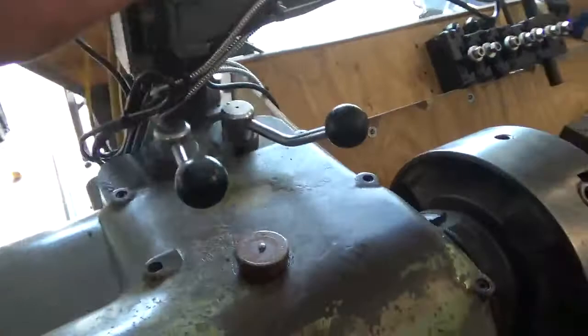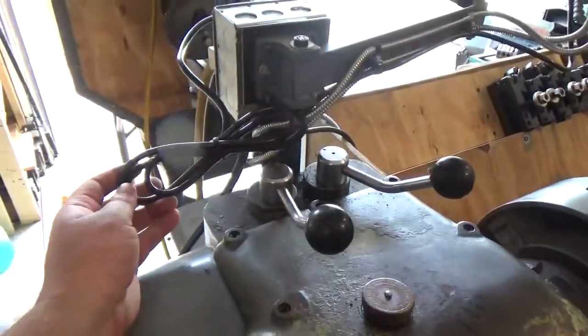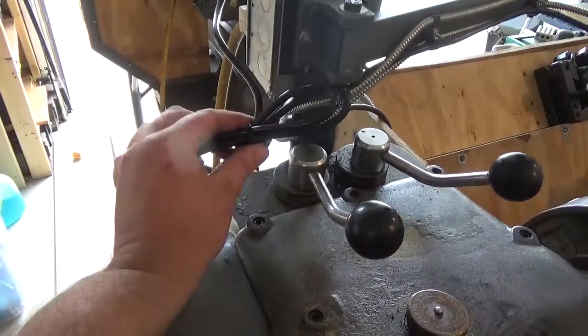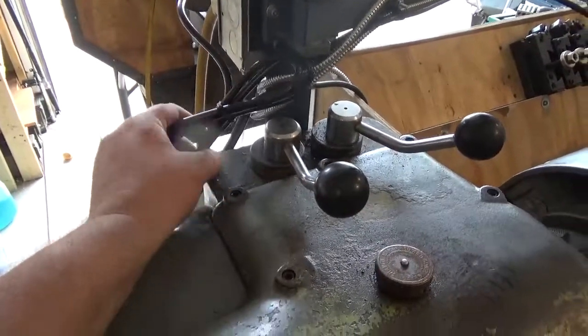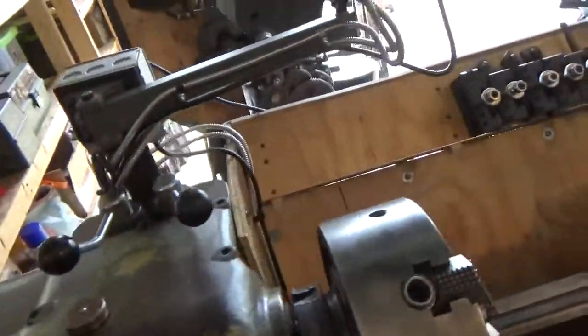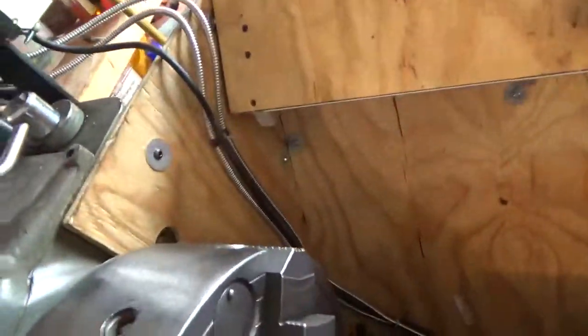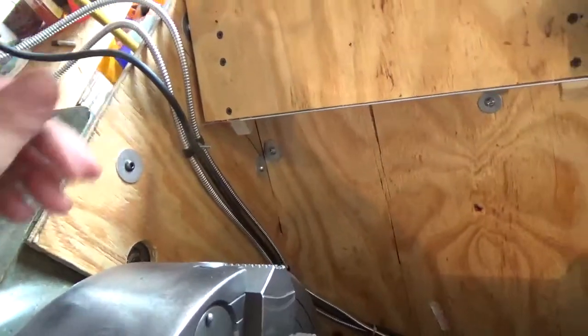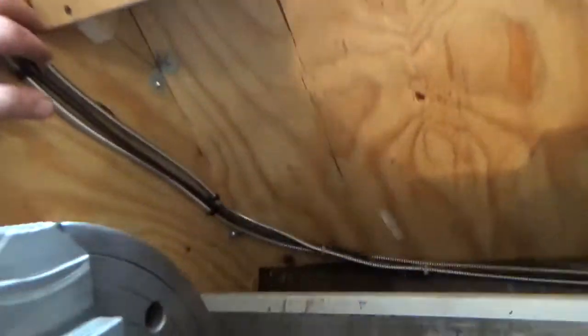On my reader head I actually have a box here. I used a zip tie to secure the cable there, because you don't want that flopping around. So it's out of the way and it's plugged in. Then I ran the cables down through here and secured them so they can't fly into the spindle, using those nylon straps and a screw through there.